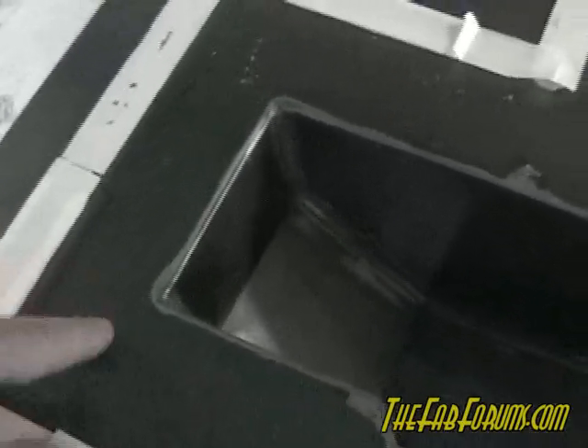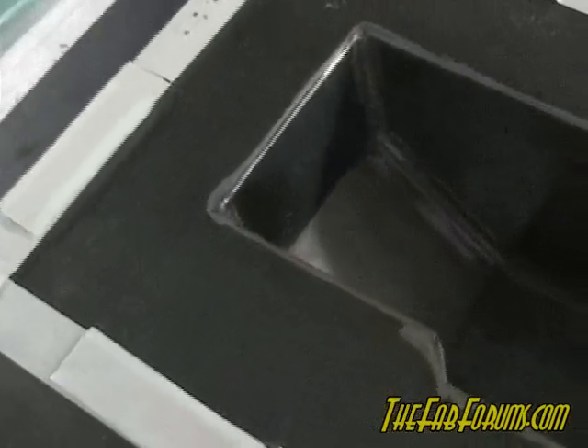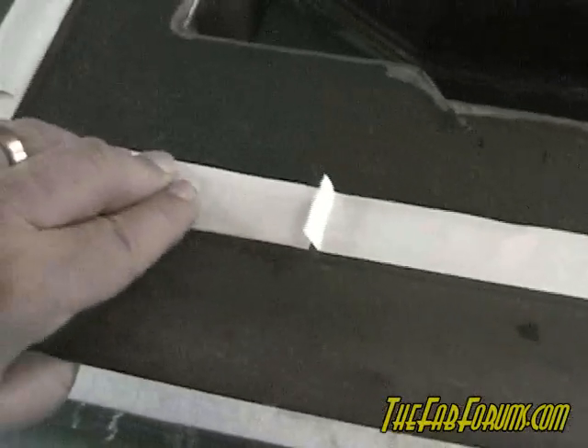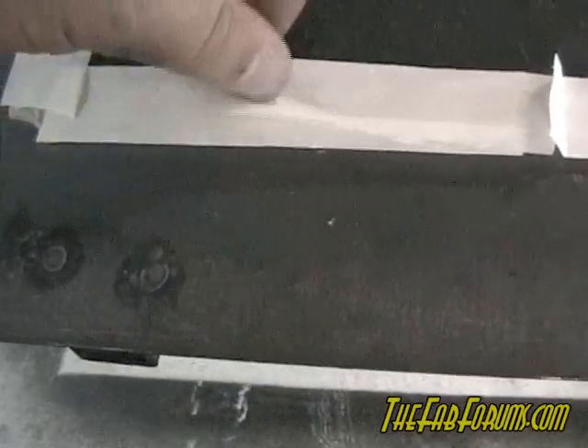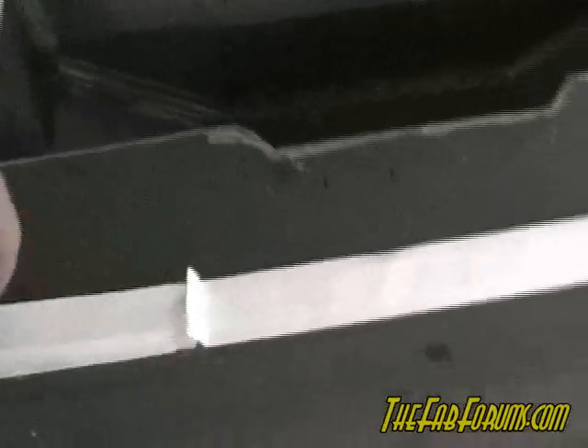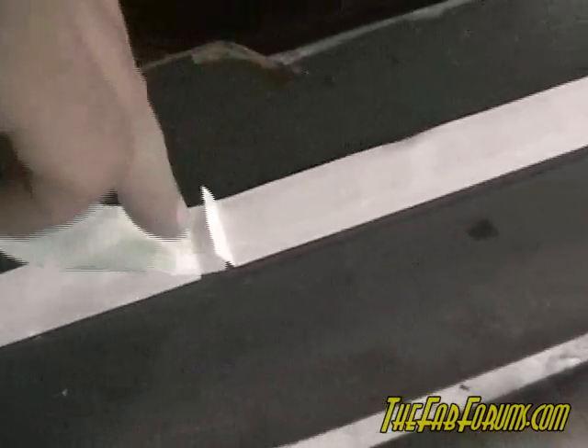I'm going to try to get it as smooth as possible, then put in these panels in the proper places — this can be the flange here. Then I'll put in another mat and stack the rest in there with a layer of resin in between each one. I'm working in this part of the mold now. I've already waxed it, contoured all the edges, and it's got PVA on it — that thin layer of film that basically dries on there to help it release. Out here is like a double-sided sticky putty, and this is what the vacuum bag itself will attach to. I've pre-put little fingers in there so the bag will stick up on both sides and have enough material to sink in without having to stretch.